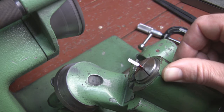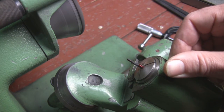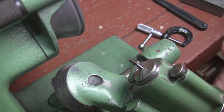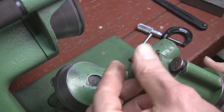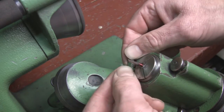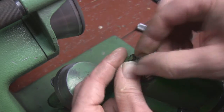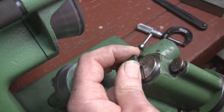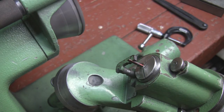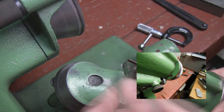I'm happy with it. Now it's time to relieve the cutter. I'm going to loosen up my collet so the cutter blank is now loose, and I'm going to bring up this little alignment tool built into the grinder. I pinch them together — and it should be noted that the red dot is in the window, which we talked about in the previous video.